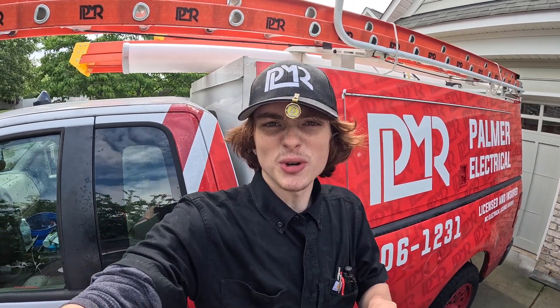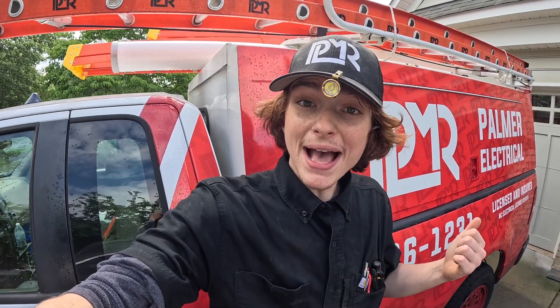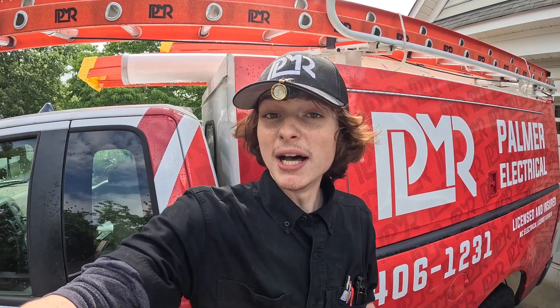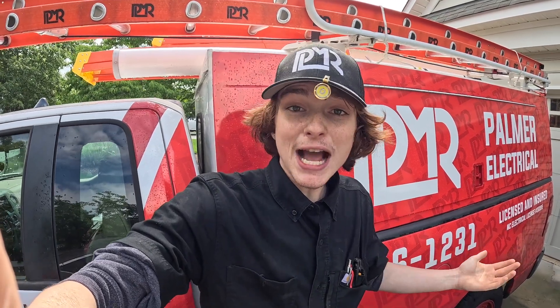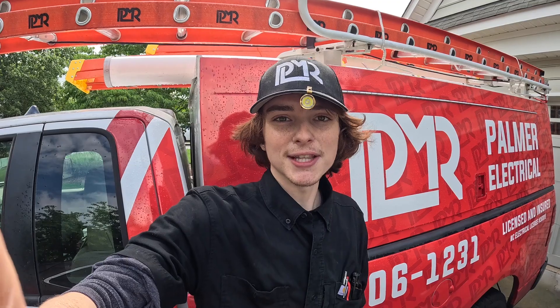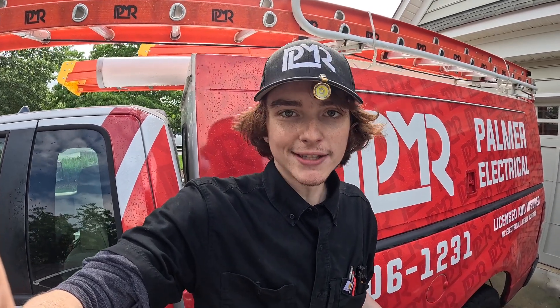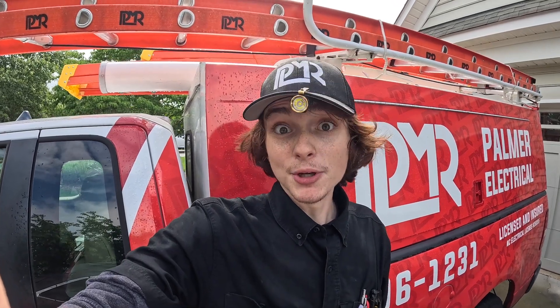I'm at my customer's house today doing a few things throughout the house. I changed their attic exhaust fan motor, and I'm also adding a few receptacles throughout the house. One of the receptacles I'm adding in the garage is a single gang box with a GFCI outlet, and then we're going to turn it into a two gang box with a quad outlet, with a GFCI protecting a regular outlet next to it. If you're in the electrical industry already, this will be pretty simple for you, but leave a comment on how you think I did. Maybe if you're a homeowner or trying to DIY something similar, you can get some wisdom from the video. I'm a licensed electrician in North Carolina. This is very common for me, and this task specifically gets done pretty frequently because people want outlets — it's for convenience. People don't like having to use extension cords, which is dangerous and also annoying. But without any further ado, let's get into the garage and get started.